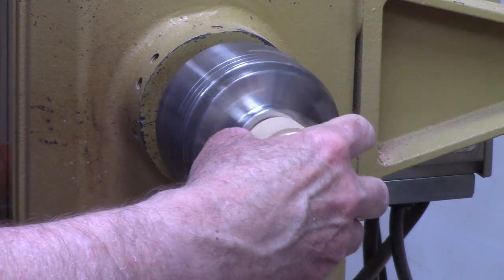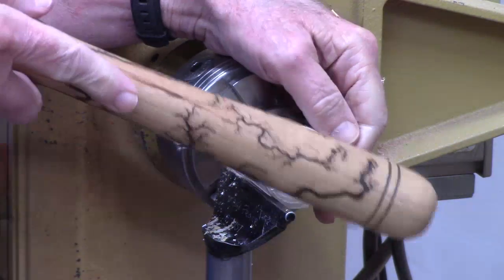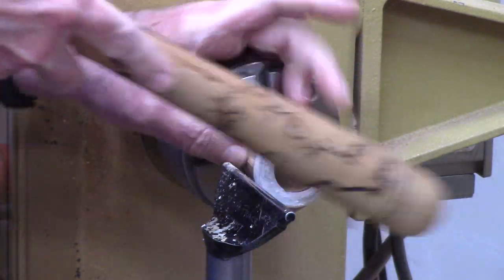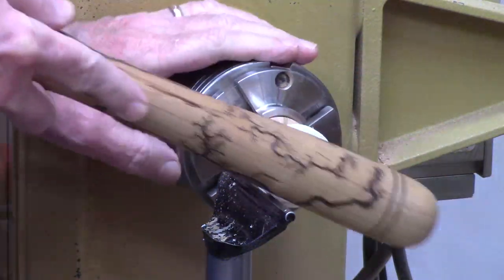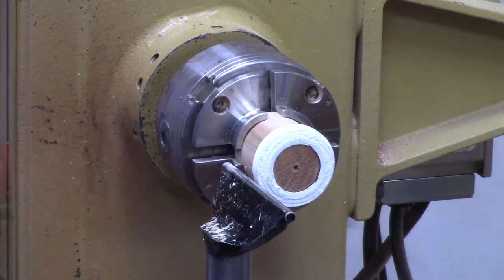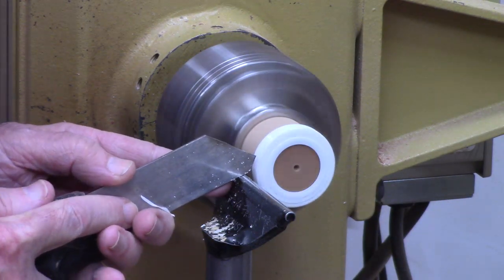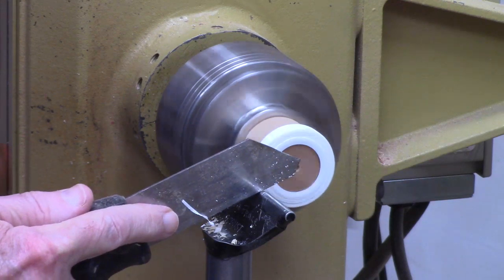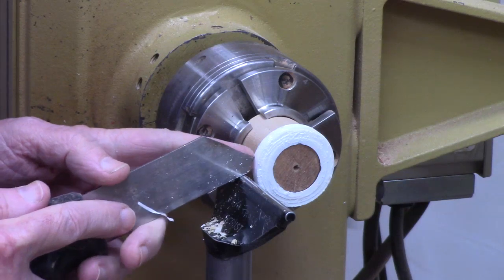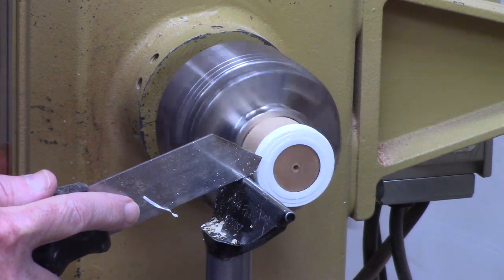Slight chamfer toward the front, and let's see if that'll fit on. Yep. And then I'm thinking I can just bang this on. This PVC will hit that shoulder and it should hold just fine. Yeah, that's running true. So now I'm going to just take off that. Let me reevaluate. One, two, three threads. Okay, I think I'm going to cut through the middle of that last thread.